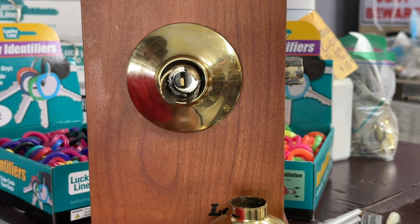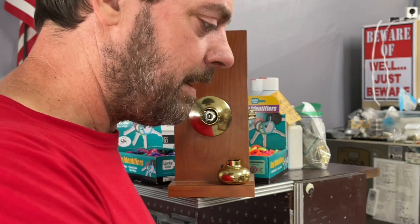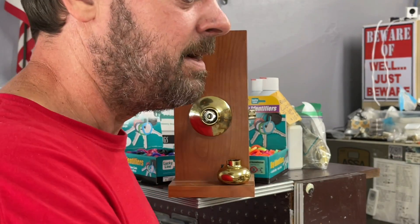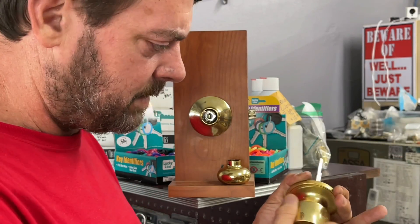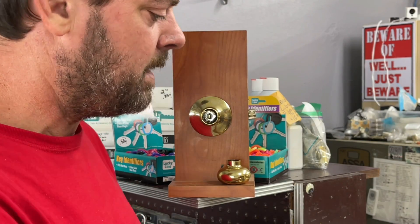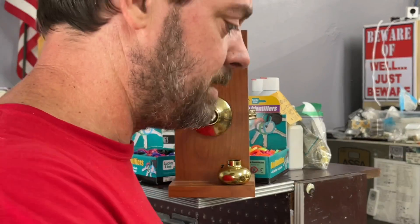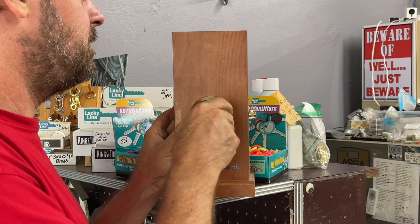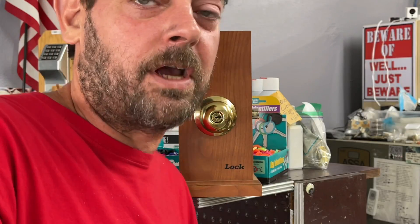There is nothing worse than a spin fail, and it almost always happens when it took forever to open the lock to begin with. Just remember that next time you have a Schlage lever handle or doorknob lockout. It doesn't work on other brands — on those, even with the core turned, the retainer won't depress in the locked position because it's a totally different setup. So Schlage lockouts, just a little bit easier without having to worry about spin failure. Thanks for watching — if you have any questions, comments, or ideas, post them in the comments and we'll catch y'all next video.